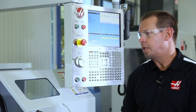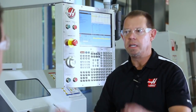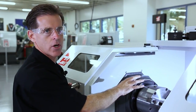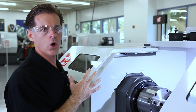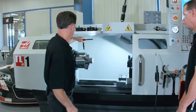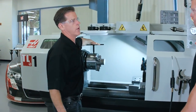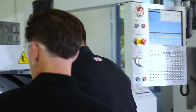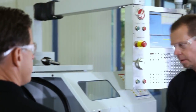We've talked a lot about the enclosure, mostly focusing on the outside. When I was opening this door earlier, I noticed this bulkhead looks a lot different. We've pushed the bulkhead back, exposing the chuck better. We made sure the door opens really wide to give the operator great access for his chuck key so he can swing it around, clamp and unclamp his parts. So there's no more interference between the chuck key and the bulkhead — that's a big improvement.